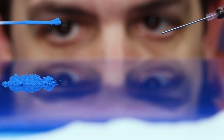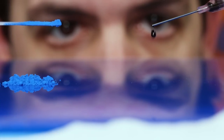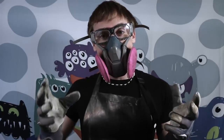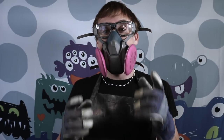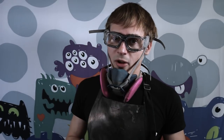Keycaps would be pretty boring if they only came in clear and white, so let's look at what goes into making them more colorful. Pigment commonly comes in two forms: dry and liquid. Dry pigment is designed to be added to your resin to change its color — it is easy to portion by weight but requires a lot of mixing to fully integrate into your liquid resin. Liquid pigment is dry pigment which someone else has already combined with a binder agent, making it much easier to mix with your resin, but it can be quite difficult to handle due to how concentrated it is. Colors and other additives are an art form on their own, so we urge you to experiment and be creative. We're about to start working with some chemicals that may or may not be dangerous to your health, so please evaluate your gear, your space, and any other concerns before working with these materials. Remember, only you are responsible for your personal safety.